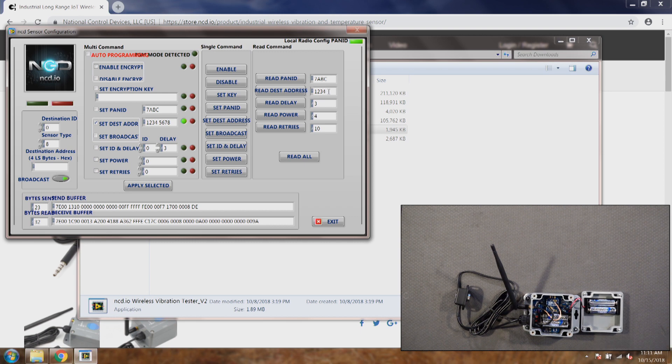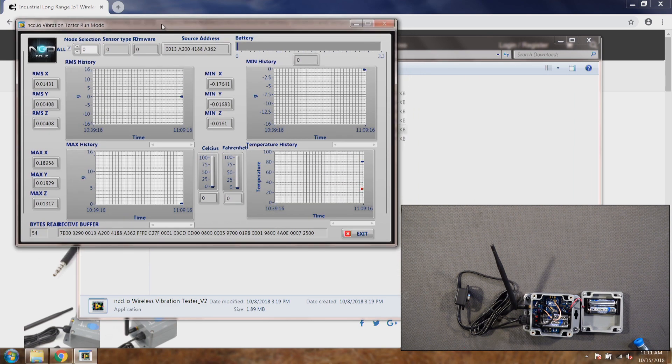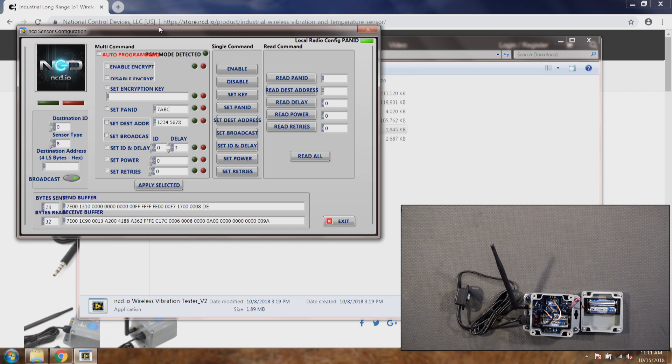I'll go back, click run, and hit reset. Now the data will not come to this UI because the sensor is sending to a different destination address than the modem. To summarize: power is the first cause, PAN ID is the second, destination address is the third. To find the correct destination address, you can pull out the modem and the wireless module and read it, or plug the modem directly into XCTU to read the destination address from there.